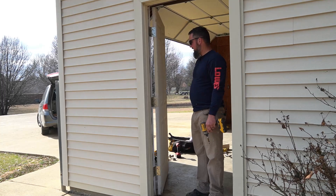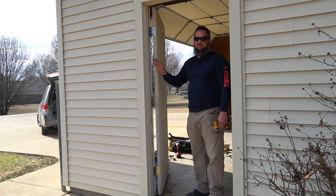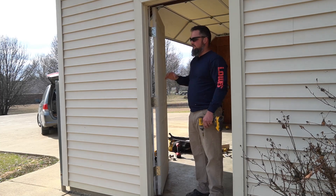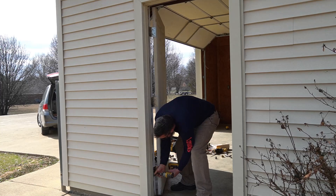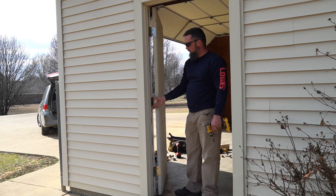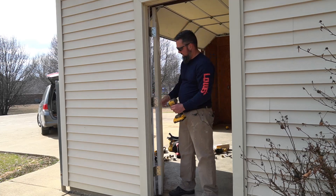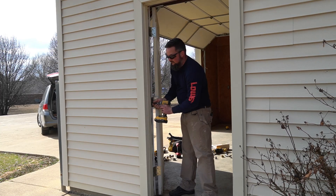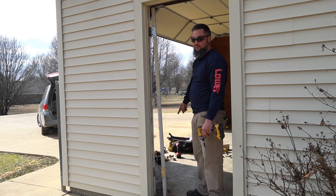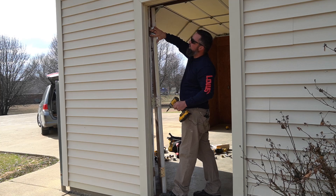First thing I'm going to do is take the door off the hinges. In a house I'd definitely do this because it makes it a lot easier — you won't bang your exterior trim, interior trim, or mess up your floor. If I pull the door off the hinges first, there's also a solid chance they used a long screw to install this to the studs, so taking the hinges out also removes those screws rather than just popping the hinges. I'd put something under the door in a house, but here it's a concrete floor — and look, I've got two long screws up here.